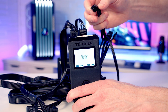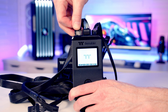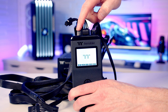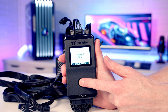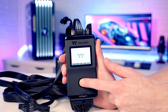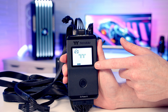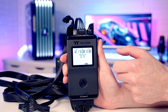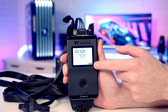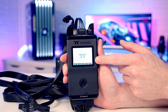Just to show you that you can plug in a 6-pin cable, I'm going to unplug the 2-pin cable from the PCIe. For our EPS cables, I'm going to unplug one, leaving a 4-pin connector and a 6-pin PCIe cable plugged in. To run automatic mode I'll hold the button in for five seconds. It automatically works its way through each connector — checking the 24-pin, then the CPU connector, then the PCIe cable (no 12-volt high power reading since that cable isn't plugged in), then SATA, then Molex — and then you hear a click as the power supply goes off. Because the screen never went red, they've all passed.